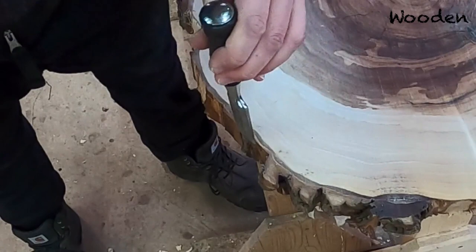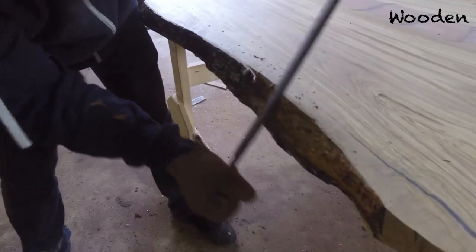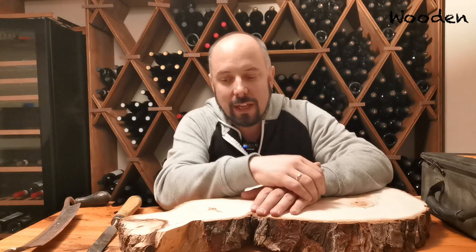If it has the bark on it, very often it's easy to remove because you can already see a lot of gaps and you can just peel it off yourself, or with a little bit of help. A couple of things you can typically do: just take a chisel and chisel it away, or there are drawing knives where you can pull and peel them off slowly, and they magically disappear and you have the live edge.